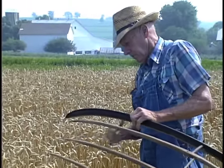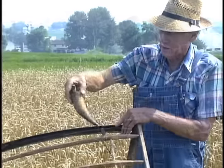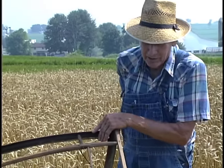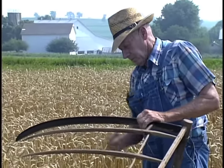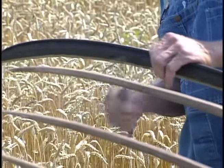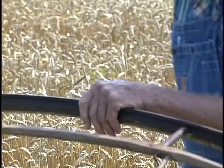That's a whetstone. We keep it wet if we can in our pocket, made out of a deer horn or a cow horn. This was hooked onto the pocket, the back, and water carried, and these stones work the best when they're wet. It's not a full sharpening, it's just to tune up the edge, to fine-tune it. It has to be ground or hammered for the main cutting edge, but then to fine-tune it, you use a whetstone.